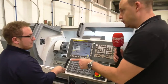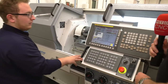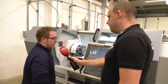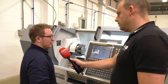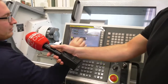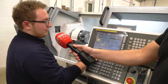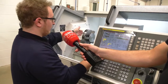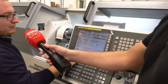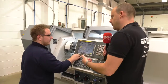Before we talk about the CNC element and the manual guide — talk to me about the ease of operation, the fact that this control moves along, setting the tools in the turret. Has it been easy to get to grips with? Oh yeah, very easy. It's literally just like setting up a multi-tool post. Setting up your datum tool, for example — you go in here, currently we're on tool one which is our datum tool, you can have any tool as your datum. Just select tool datum and that's it — manually face the front face, click datum with your datum tool, and it's set.